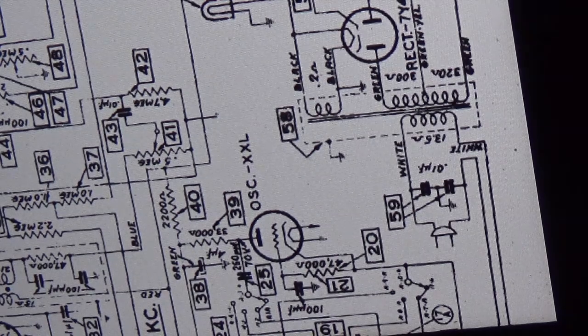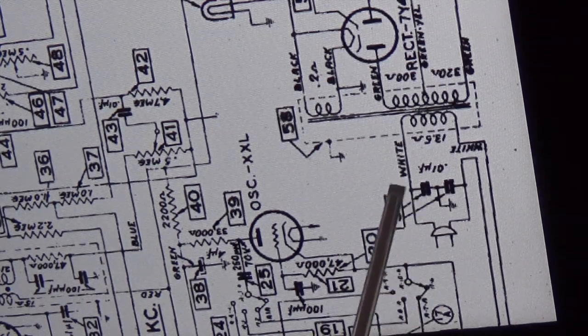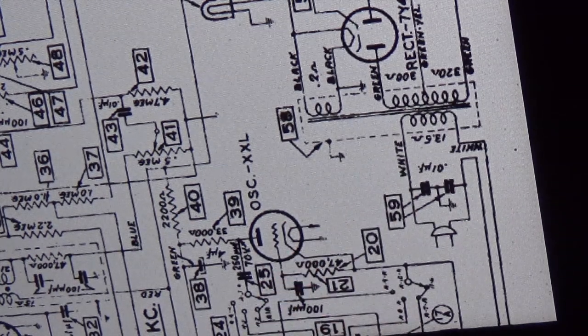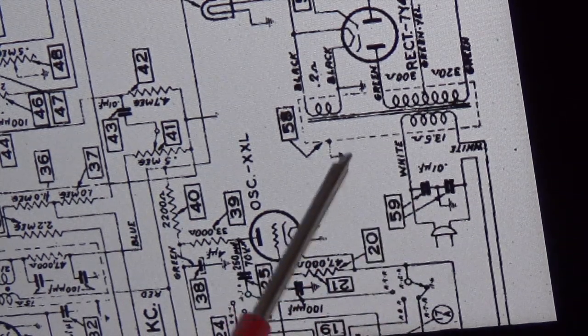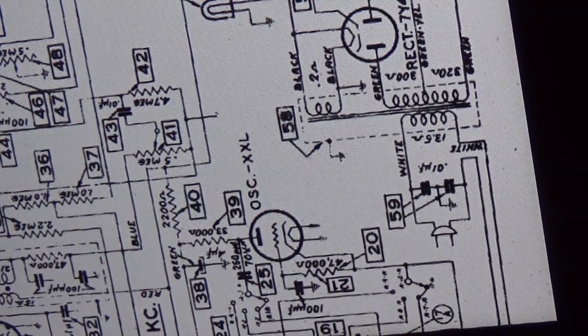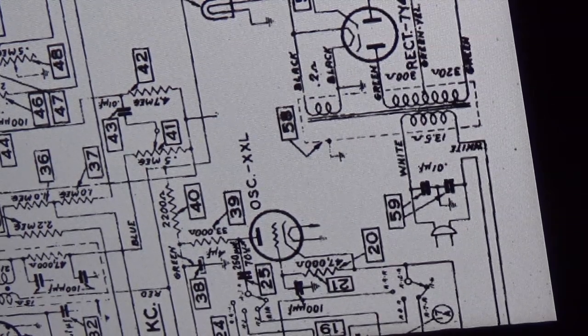That's not a good thing. So we put in a pair of safety caps. They're inside the Bakelite block, which I'll show you in a second, and it makes the radio much safer. So if the caps fail, they fail open, and you don't get shocked. Right? It's essentially what happens. So that's the update on where we are.